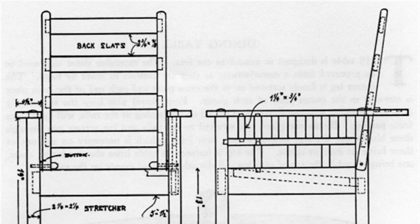Measure up 6 inches from the bottom of 2 legs. Lay the legs flat and place a 4-inch x 15-inch side rail between them. Make sure its bottom is flush with your mark. Attach — you can either screw through the leg or pocket-screw from the rail into the leg. Using pocket screws, attach 3 evenly spaced 2 and 1/2-inch side slats. They will be flush with the top of the legs.